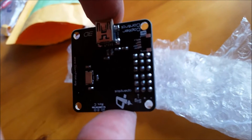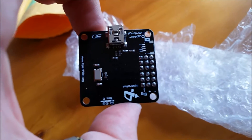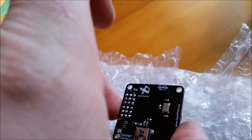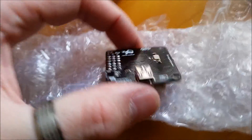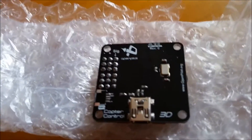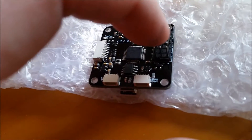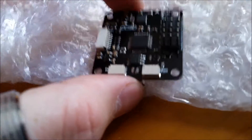This is a great board, especially if you don't like tuning and stuff like that. A lot of people just set it up and run through the ground control station through the computer — it's got a micro USB plug right there — and they get it set up that way instead of messing around with the KK2 board. It's pretty easy to hook up, no soldering required. The ESCs plug in here, and this goes through your receiver and then you mount it.